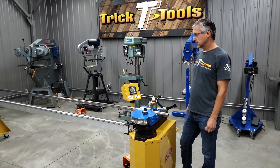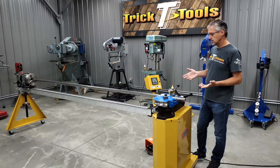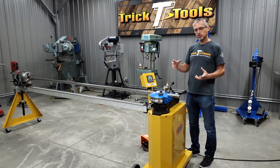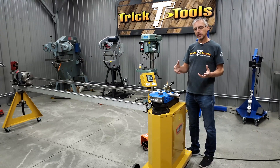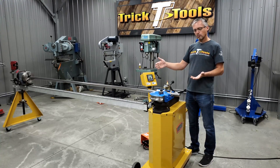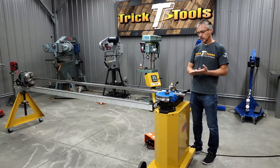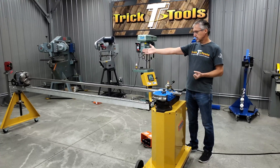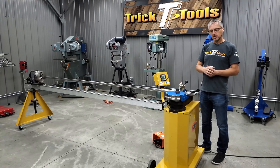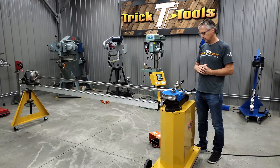The positioning table is great for long parts, especially when you have multiple bends. Sometimes the advantage of the positioning table is to keep your bends all in a single plane, and sometimes you want to be able to rotate slightly out of plane — it's equal advantage in both areas. Keeping the tube in the indexing table will help you keep a multiple-bend part, like a roll cage hoop, all in the same plane without a whole lot of re-leveling and measuring between bends.